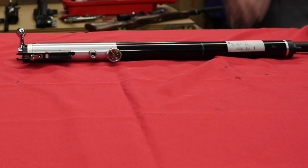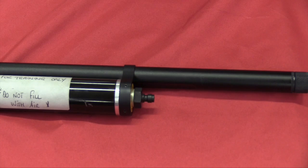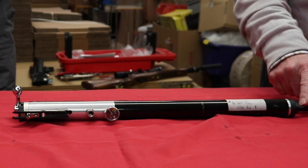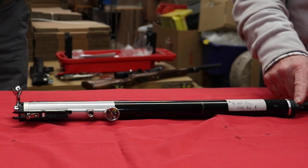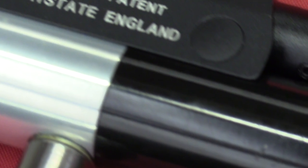At the front where the filler is, the pressure gauge, and the main valve assembly. A filler valve leak will show through air coming back out of the filler or around the sealing area. A pressure gauge leak will show around the gauge area. And a firing valve leak is nearly always indicated by air escaping through the barrel.